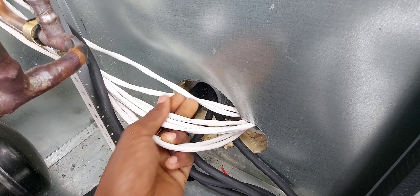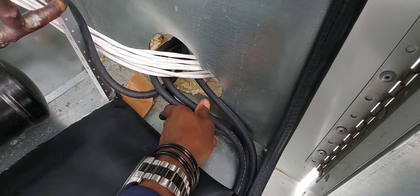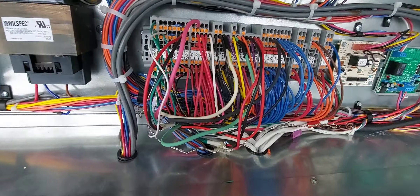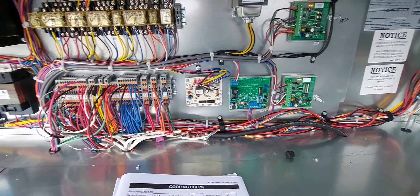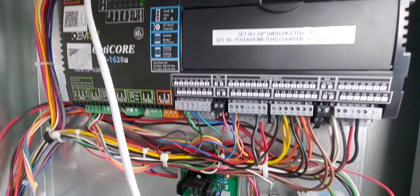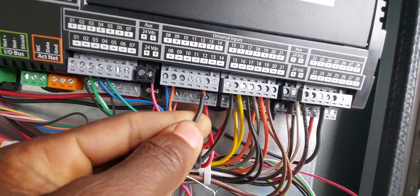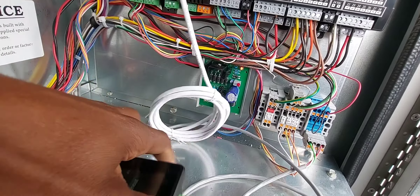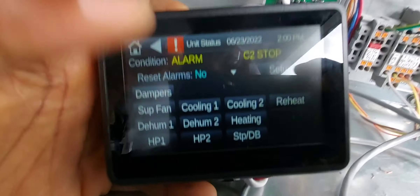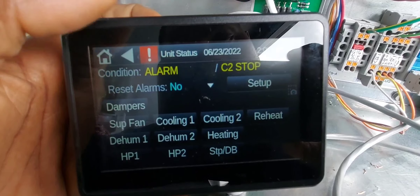Here's my scale — I'm adding R-410A refrigerant, and I'm just using a hose with a shutoff valve because I have the smart probes: suction, discharge, and clamps. This is a heat pump condenser — it has hot gas reheat and does dehumidification. It's also an Addison indoor unit with an EC blower fan for the evaporator. Look at all these control wires — all of this has been used, and it looks factory clean. You can't see all the terminations because I blended everything in nice.